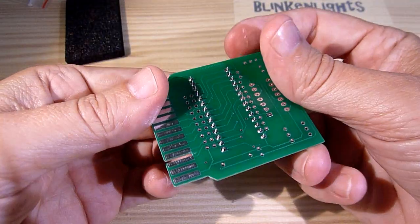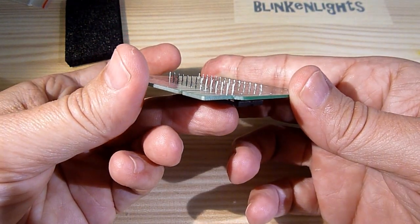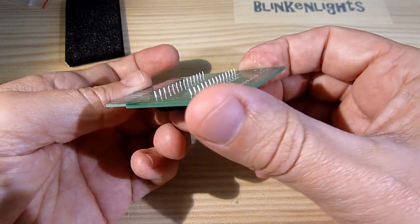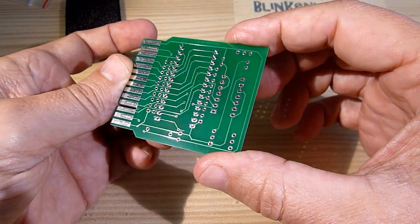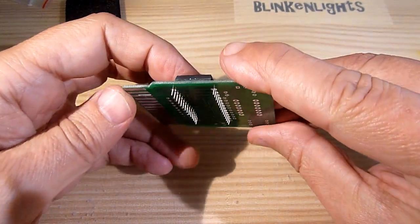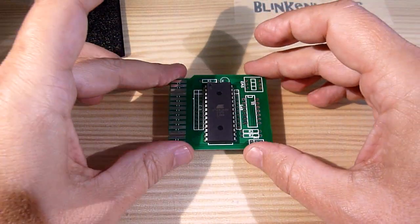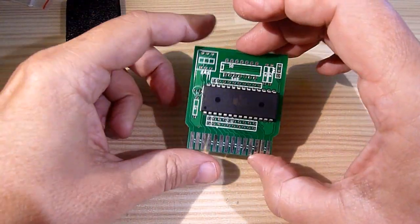In order for the PCB to sit nicely in the cardboard case, I'd like the back of the PCB to be as flat as possible, with no pins poking through. So I decided to cut the leads and IC pins before soldering them in place, and then just flood the hole with solder. Ready? Okili dokili.